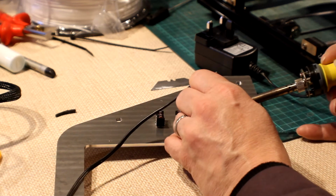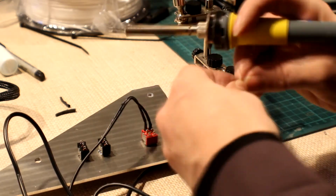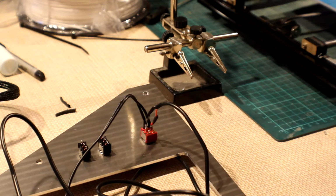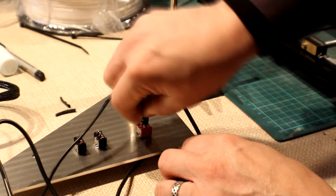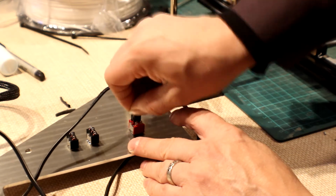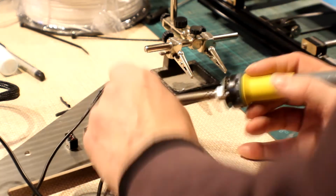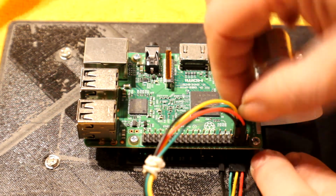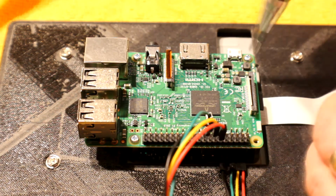I really wanted Android, and there is a way of doing that by using the Asus Tinkerboard, which essentially is a Raspberry Pi by Asus, and can run Android, and also you can get Google Play Store and stuff. It's not that easy to do that. There's a lot of fiddling about, and the other thing I needed to do, which you can see me do here, is replace the 2.5 amp power supply unit that the Raspberry Pi uses with the 3 amp power supply unit that the Asus Tinkerboard uses.